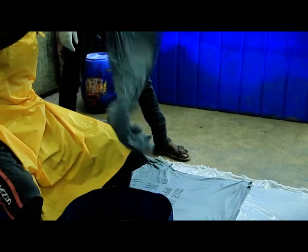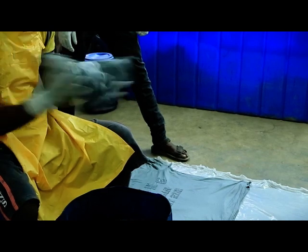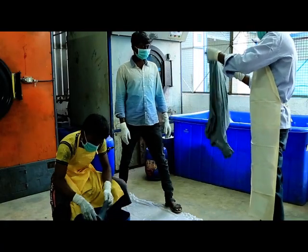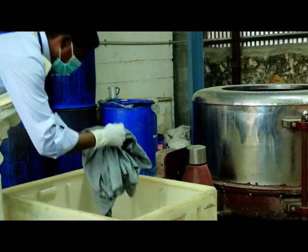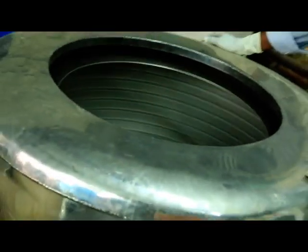For another 10 minutes the garment should lay flat, so the paint can fully absorb. After drying in the tumble dryer, it will go through another washing process. The bath contains acetic acid to form a permanent bond to the fiber and softener for a smooth hand feel. The result will be a vintage look with faded and washed out effects, especially around tricky seam areas. Due to the short dyeing period, the paint will not reach there completely.